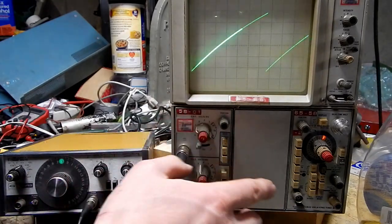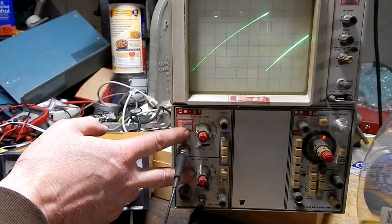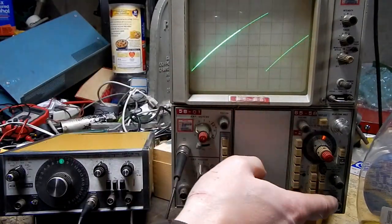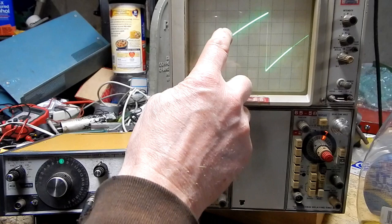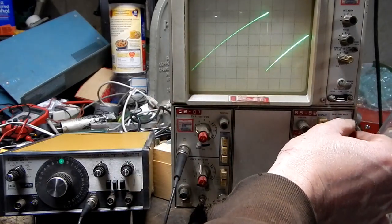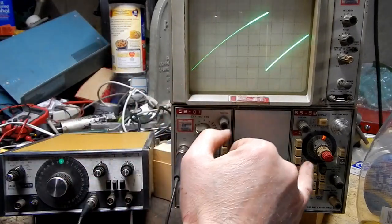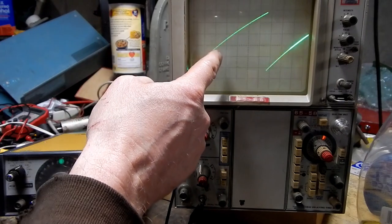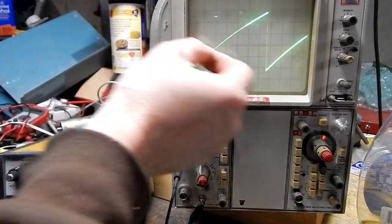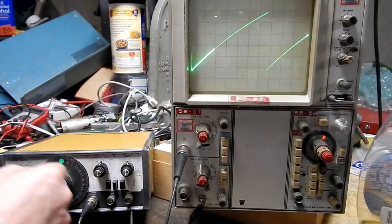I've got my old data pulse sweep generator hooked up to this thing — and look at that, got a nice waveform there, exactly what we would expect. I also checked the second channel and the second channel works. I took a quick look online and it turns out yes, this is another bay that's available — so if I were to get another one of these channel modules in here, this could be a quad channel oscilloscope. The other thing that's kind of neat about this oscilloscope — which made it probably a pretty big deal back in its day — is there's a button here that when you press it, it activates a little cursor that you can adjust the position of. So if you wanted to make a really precise measurement using these graticule lines, which makes sense. Pretty cool old scope.